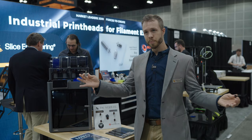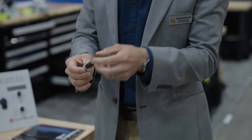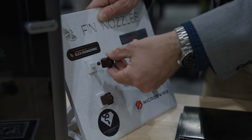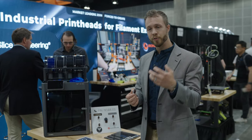The reason it's called 'insulated' — that's where the 'I' comes in. We've designed a silicone boot out of a very high-quality resin that clips on directly to the nozzle, ensuring that only the very tip of the nozzle sticks out. So when you're blowing a lot of cooling air — for example to get a really nice surface finish — you're not going to over-cool the tip of the nozzle in a way that creates stringing, other negative effects, or clogs. That's a huge benefit of fully insulating the nozzle.